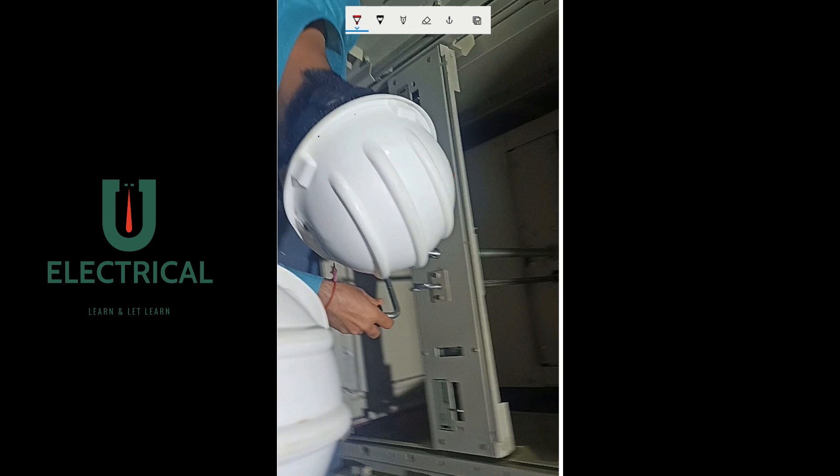The shaft visible on the screen is called the rack in/rack out shaft. From here you will be allowed to insert a handle — a lever. You will be rotating the handle clockwise or anticlockwise depending on the desired position of the circuit breaker. If you want to rack in the circuit breaker, you will move the handle in a clockwise direction.